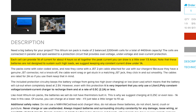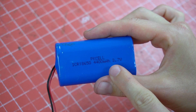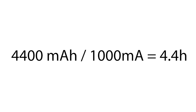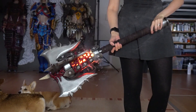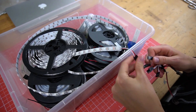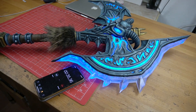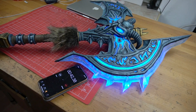How many LEDs can you run with this setup? Adafruit recommends no more than one ampere as current draw per cell. With 20 milliamps per LED at maximum brightness, that would be 50 LEDs in total. With a 4400 mAh LiPo battery with two cells, these LEDs would light up for around 4.4 hours. However, I rarely use white and mostly go with a colored animation, and I barely turn all LEDs on at the same time, so I often use hundreds of LEDs and the circuit still runs fine. If you connect too many though, the LiPo battery will just shut down — nothing gets hot or burns, so don't worry. The only way to figure out how long an animation really lasts is to measure the time until a fully charged battery is empty.